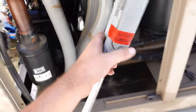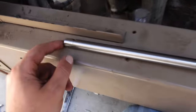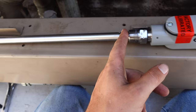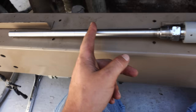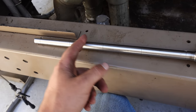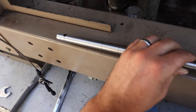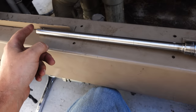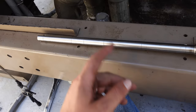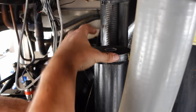This is what killed this compressor initially. It's got a little sensing rod in there, and the factory obviously does not want you playing with this. It's just registering the level using some kind of electronic sensing to register the resistance. It reads refrigerant level — the other one was bad and broke. I'm going to be putting the good one in. It's just a hole up top here.